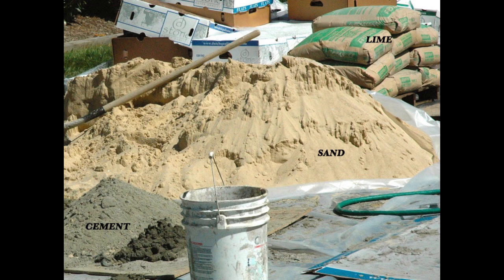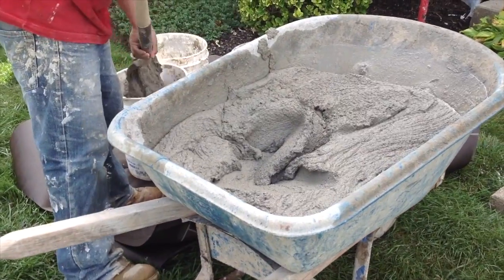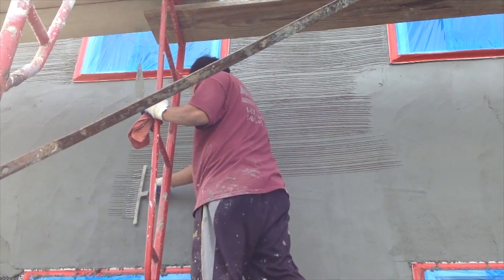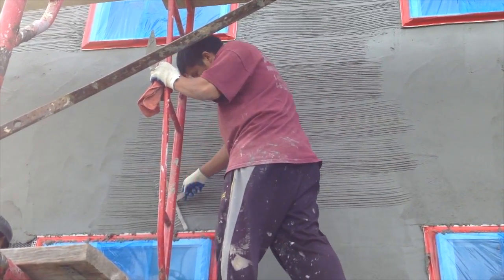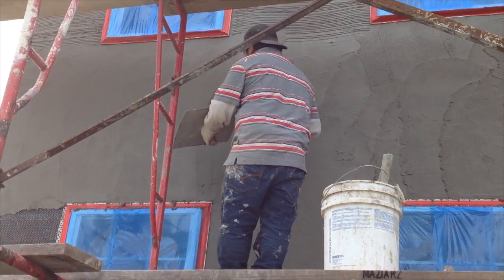Mixing materials for mortar and plaster for scratch and brown is like mixing a cake — there are quite a few mix designs. One typical mix design for scratch and brown is one part cement, three-quarter part lime, and two to four parts sand. These ingredients are then mixed with water in a mortar mixer. We poured it from the mortar mixer into the wheelbarrow, and our applicator puts it in the buckets to get over to the scaffolding and put it right onto the hawk and trowel. Our scratch coat goes on first, right onto the lath. It's called a scratch because as it starts to set, we come over and put a scratch in it to key the next coat right into it. After a two-day, 48-hour cure, we put our brown coat on top of the scratch — that's our second coat — and then we smooth it out at the end.